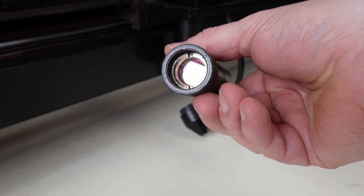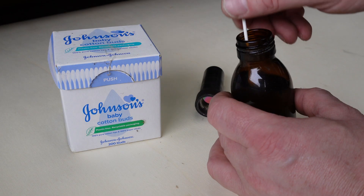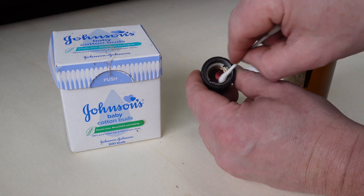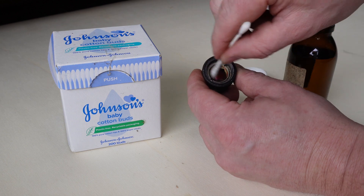And that brings us on to the mirrors and the lens. I like to give them a quick visual check and clean every day before I start work. This helps to keep your laser running at full power and also extends the life of those parts. I've been using the same mirror and lens in this machine for over eight years, and they're still like new — simply because I've given them a quick clean every day before starting work. A little IPA works great for cleaning and it's inexpensive. You can pick up a litre for about £10 or $10 on Amazon, and it'll literally last years.